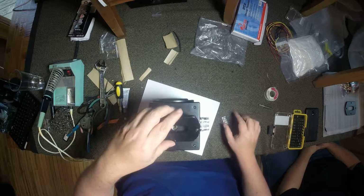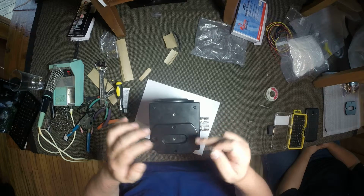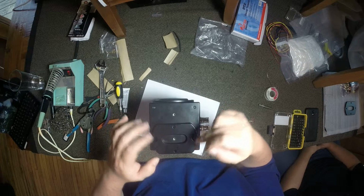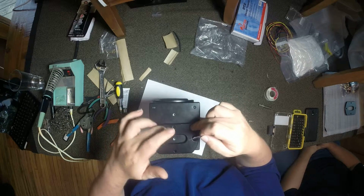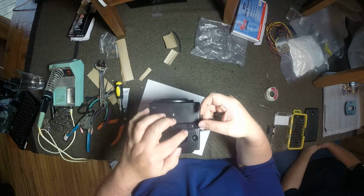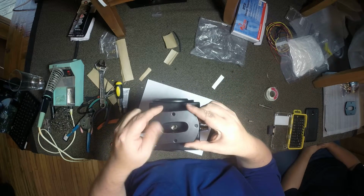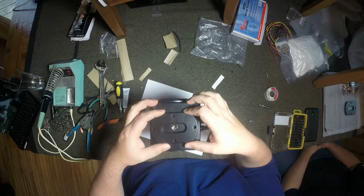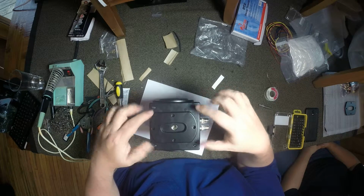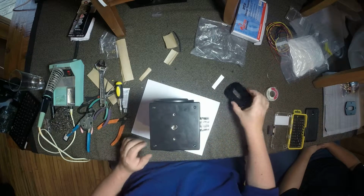And at that point, I recommend using these on top of the stand instead of the speaker, if you've got the stands. Put them on the 4 corners of this, so when you put the speaker on top, you don't have paint on paint and you're not scratching both surfaces. Just put them right here in the corners, and then these 2 screws will torque down the plate to the rubber feet. That'll keep everything from scratching. But if you're going to put them on a bookshelf or next to a computer, you're going to want them out here over top of the screws instead. So you can use them either way.